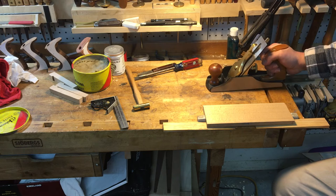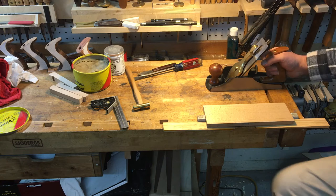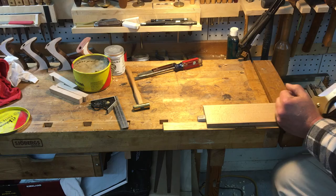In this case I went for the 55-degree bed, and it's on here. The iron is set up for pretty thin shavings — not quite as much as you would for a smoother, but pretty close — and the mouth is set up about the same. We'll clean it out and take that same piece straight to it.